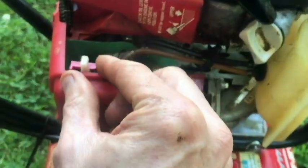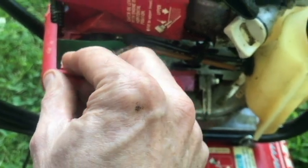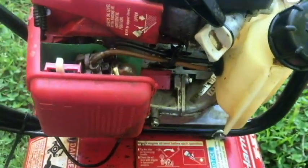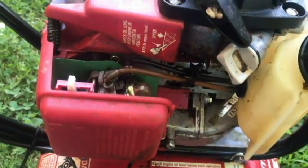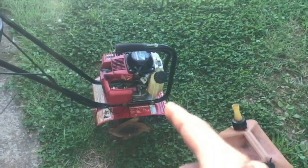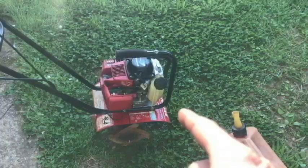Let me try to get it into the run position. Alright, warm up a little bit maybe. We've got the switch here, the trigger here activating the clutch. In my case the clutch is not working — either the clutch is not working or the transmission gearbox is messed up. The tines don't move. But the motor is great.